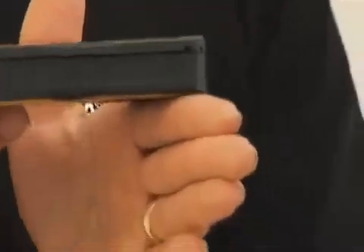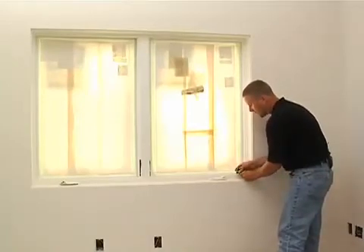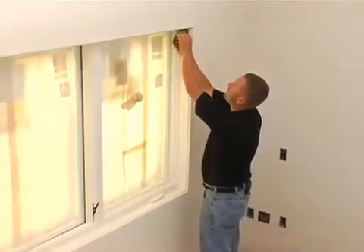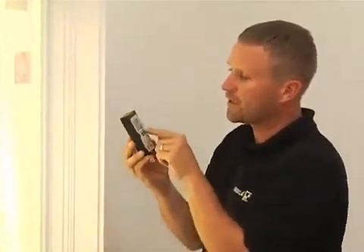One of them is this flip-out piece on the back. If I flip that out, it acts almost like a tape measure where I can hook something and get a measurement from the corner. If I flip it out one more stage, it becomes a point. That point fits into an inside corner — let's say this window jamb here. So I can go inside that corner, point to the opposite corner, take a measurement, put the laser into the other corner, point at the opposite corner, take a measurement, and if they match — which in this case they did — that means the window is absolutely square.